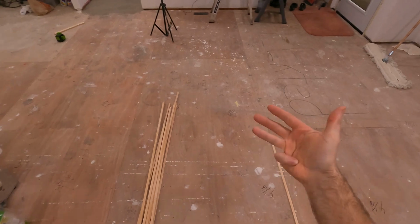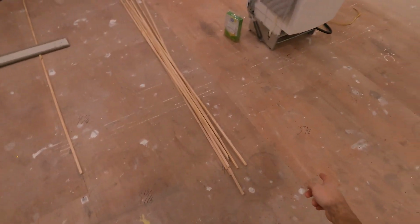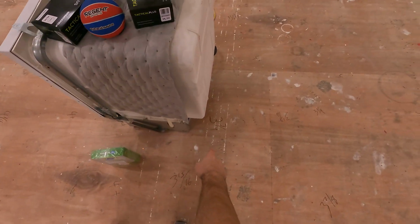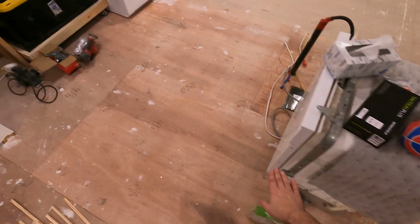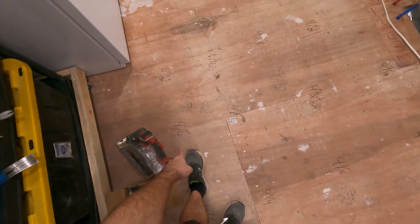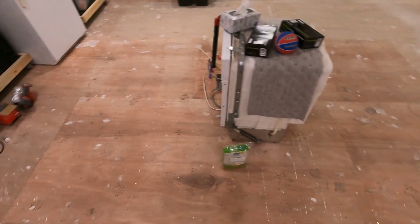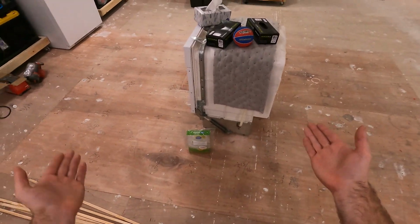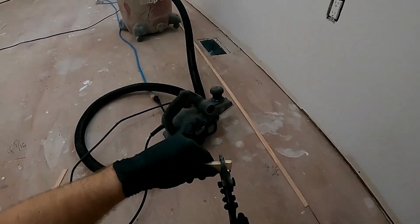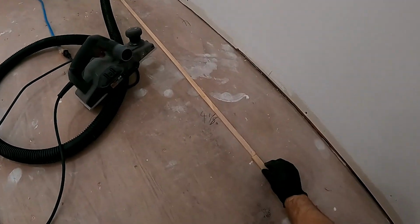One of the big reasons it's worth it is, especially on a house where I've got from 3 7/8, so that's a 1/8 inch off of 4, 3 3/4, so we're a 1/4 inch high of 4, down to, let's see, 4 1/4. I've got a 1/2 inch low from there to here. From 4 1/4 to 3 3/4, that's a 1/2 inch difference. You got to make that up somehow. It's just like a really small concrete form.